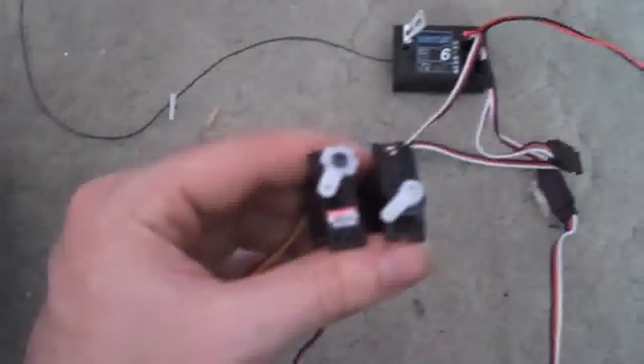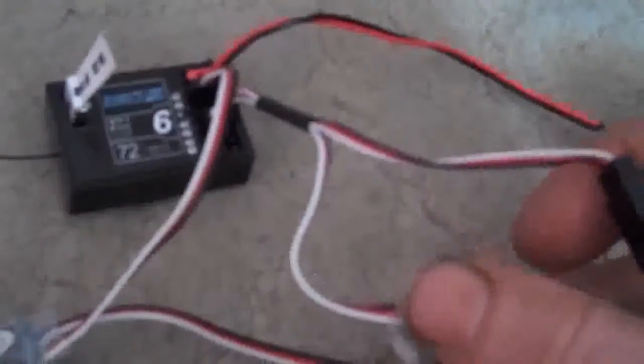Alright, I have figured out the electronic control system for the engine-slash-electric-motor hybrid. So we have our 6-channel receiver. Yeah, we're using 5 channels. The throttle is channel 3, and this switch throttle is 3, this switch is 5. So, channels 3 and 5. Let me explain what it does. Channel 3, which is the straight throttle, goes into a Y splitter. One side of the Y goes directly to this high-tech servo right here. The other side of the Y goes into this mixing module.